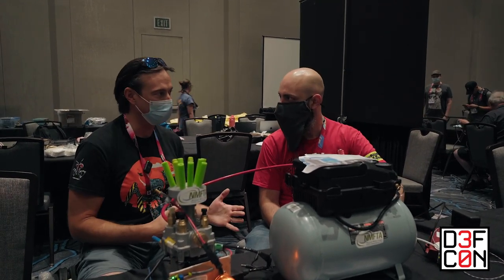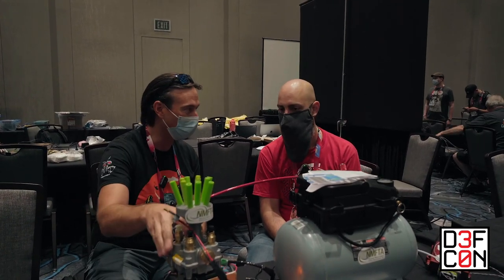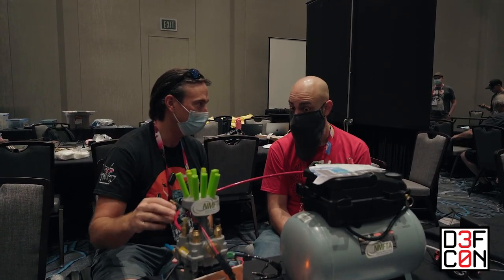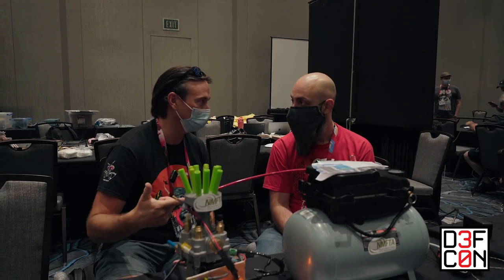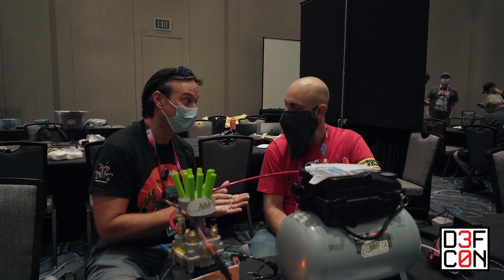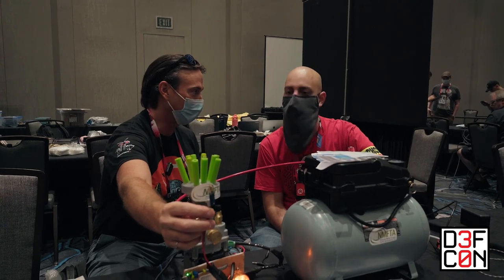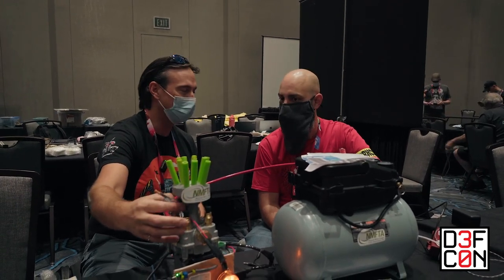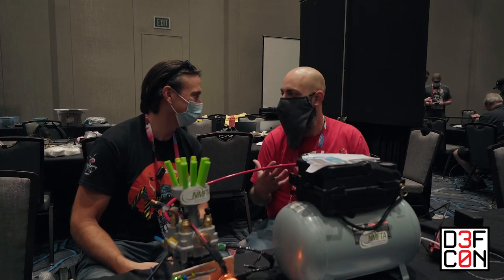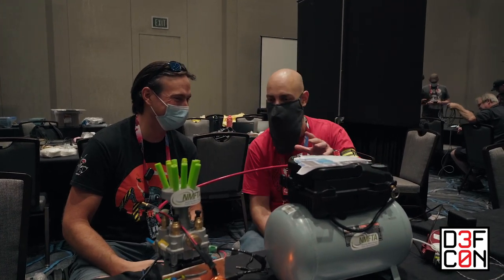You said they have wireless access points — brand new truck technology sometimes does. It's kind of a bad idea. The really unfortunate thing about what we're disclosing here is that this is power line communications technology that is susceptible to transmission. So you can actually induce messages on the power line bus, and they did not intend that, but you can do it. So this year we're just giving people an SMA connector and they have to send the right signal, because if they tried to do it over the air around here in DEFCON's RF environment — yeah, it's kind of like there's so much in the air. It's amazing that our mics are even going to the camera right now.